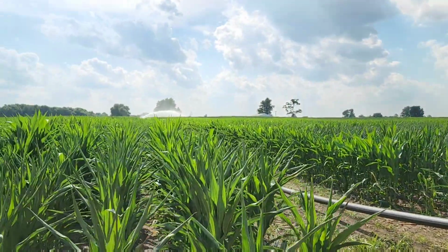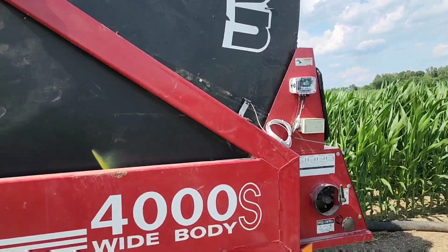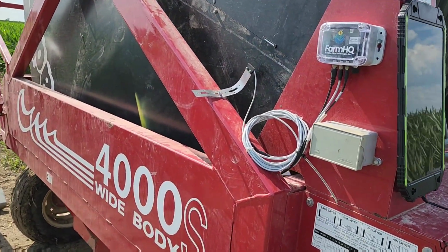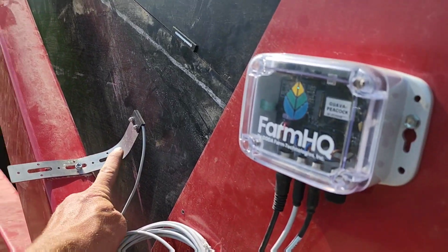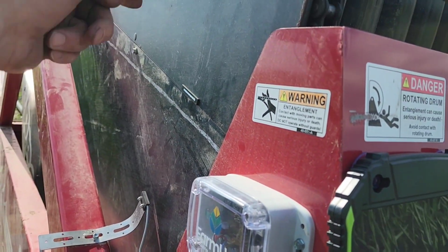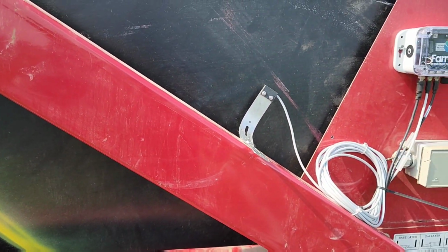Okay, well, we're back up and running, pumping water. Everything seems to be good. I've been watching these sensors go around, just making sure they're all hitting there and that the light comes on. And they have been. Best guess as to what happened is my sensor was too close, and when I unwound it, it was a sharper edge, and it was catching those magnets and dragging them and pushing them out of the way, and that was the problem.